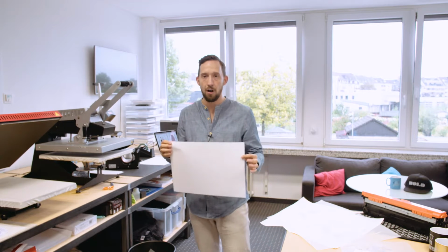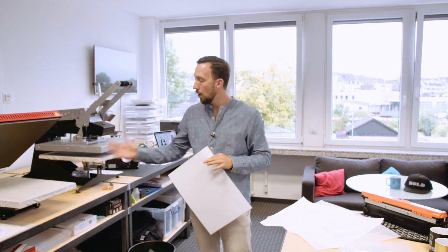Okay, and we often get inquiries from customers who have trouble marrying these papers because after 2 minutes on the heat press, you have to peel these two papers while they are still hot. And for some reason there are many variables in the process. There's the temperature, of course. There's the time for the pressing. There is the pressure for the pressing. There is the heat on the lower plate of your heat press. And all these variables must run together for a perfect peel. Of course, also the timing of your peeling and the speed of your peeling.